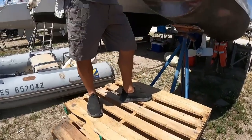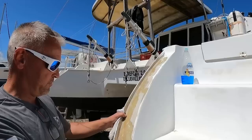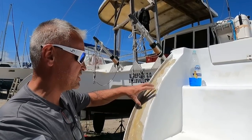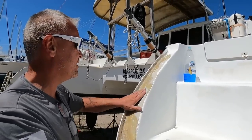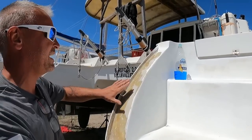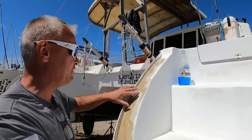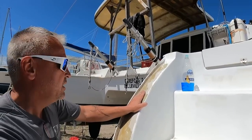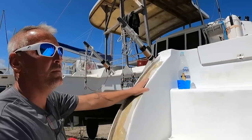He made little stairs — little people need little stairs. Unfortunately a lot of what he did didn't fall off, but we could see in certain temperatures and heat there'd be bubbles; you could feel it was soft and there were layers. Whatever products he was using — I've now sanded this back and got it prepped — it looked very shiny. So it may be that the amine blush wasn't taken off, or the sanding wasn't done previous to any of the fairing.